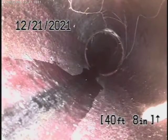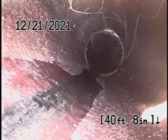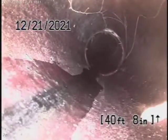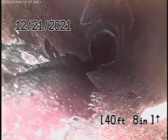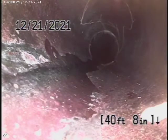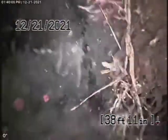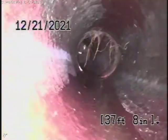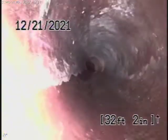We had a lot of luck from the roof vent — a two-inch roof vent — that we were able to go through, which brought us all the way underneath the house into that section of cast iron pipe and into some clay piping, which we've actually located to be underneath the house, under the structure of the building, which was obviously added on. Here's the turn that we couldn't see from the outside, and it comes back with clay pipe. This is actually going underneath the structure of the house — you can see there are some roots.